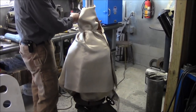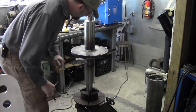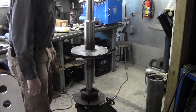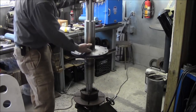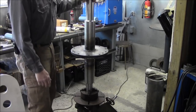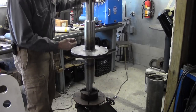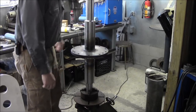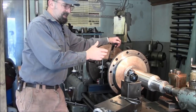All right, let's get her unwrapped. We'll get this in the machine shop — better light in there, get you a good close-up on it. Let's get it in the lathe, get it dialed in, and see how far this weld actually started making this thing run out, or if it is in fact running out, and how much all the prep — the preheating and everything else — keeps everything uniform and running true.